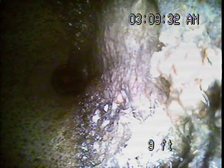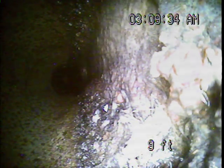The sewer line is just worn out with intrusion and standing water, and it is a party line, so we'll need to verify with the city how that's to be handled. This line does need to be replaced.